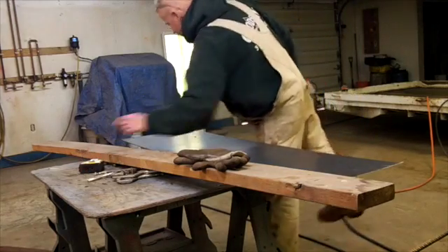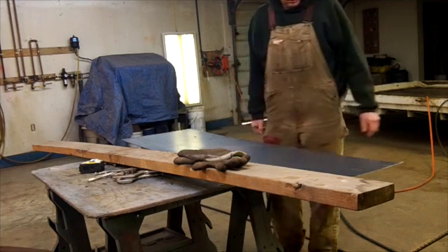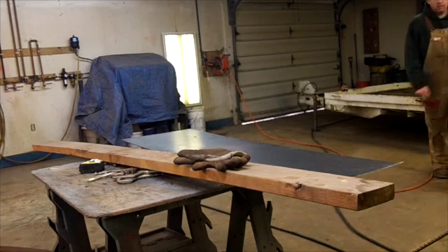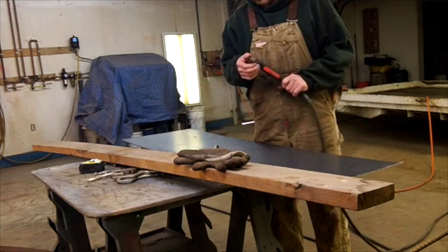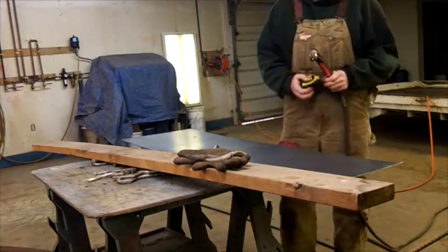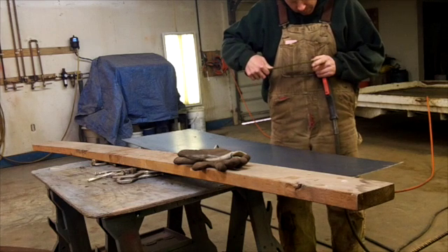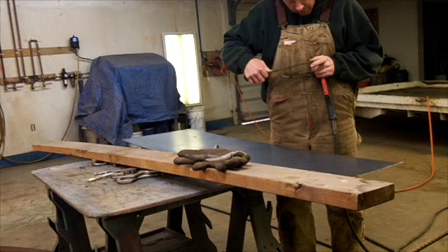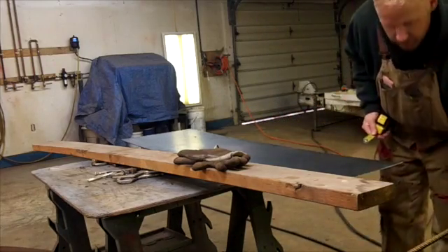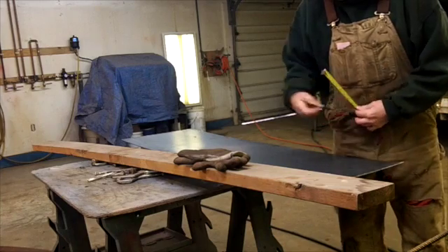As long as we're real close to 10 inches, within an eighth of an inch, we're good. I'm going to get this set up. Here's the plasma torch — I'm not going to drag cut this; I've got a standoff tip on here. Drag cutting wears out these tips pretty quick — I killed one the other day. So I need roughly a half inch to the center, which means I need to make another set of marks, half an inch back, or mark it at nine and a half and set my straight edge up.